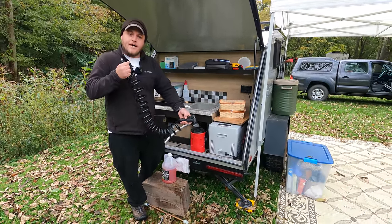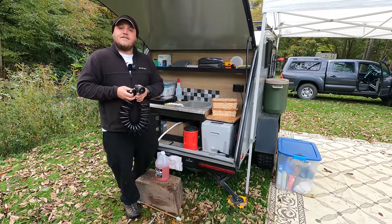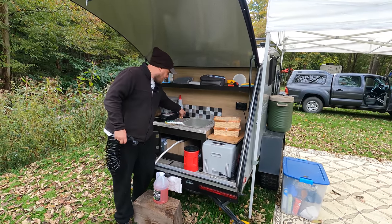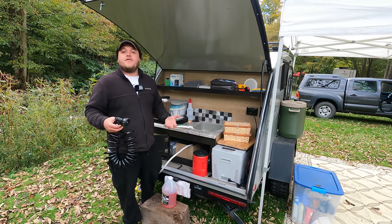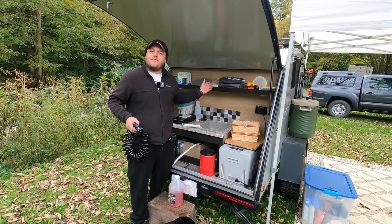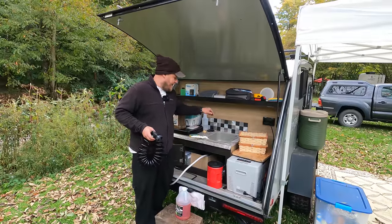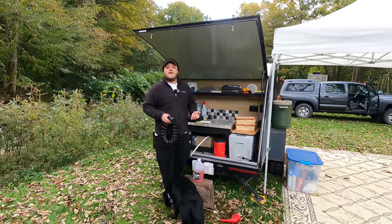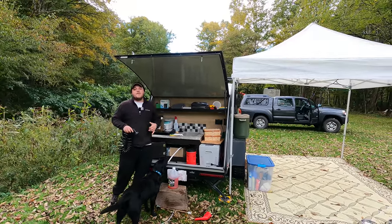You can now blow out your spray nozzle and store it inside for the winter. I remove this faucet — I'm done using the water system on my Bushwhacker for the winter months, but I'm not done using the trailer. This is just the time of year where I convert to bringing my own water instead of using the water pump. Some people pull the fuse on their water pump; I generally don't. In the spring I'll show you how to de-winterize. I hope you found this helpful — check out my other videos for maintenance tips and mods. Like and subscribe if you liked the video. See you guys next time.